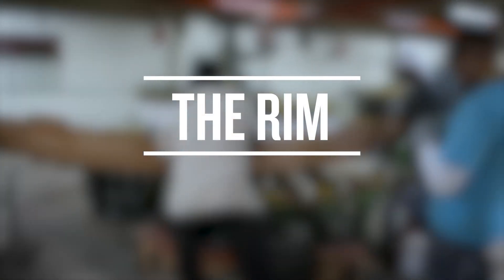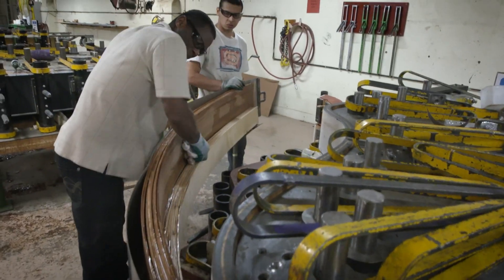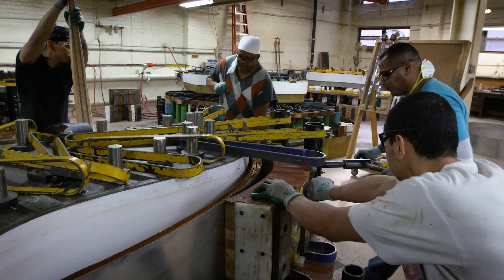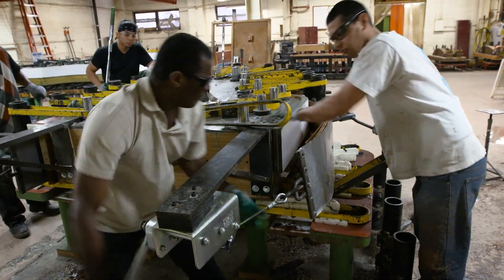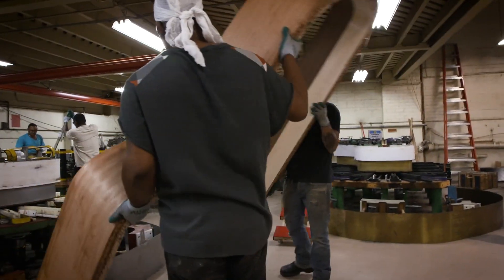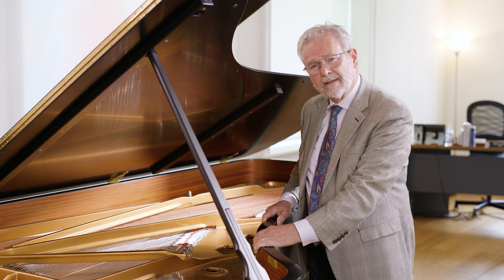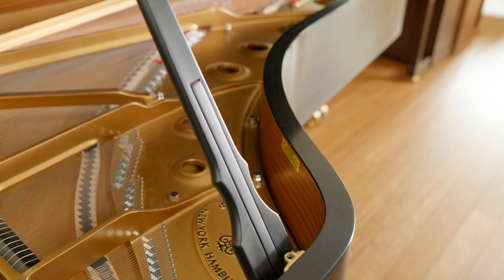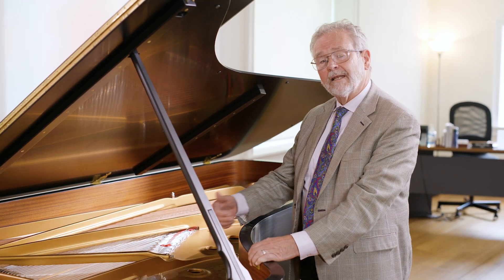Many cost-prioritized pianos feature a two-piece rim that uses different types of wood. Steinway's patented single-piece hard rock maple rim, found in their grand pianos, has been hand-bent in the Steinway factory for 140 years. Over that time, the production process has been refined to improve the stability, durability, and strength of the rim. This rim is made out of solid hard rock maple — North American maple, actually the same tree we get maple syrup from. It is the sugar maple, a very tenacious, very hard wood that does not absorb energy.